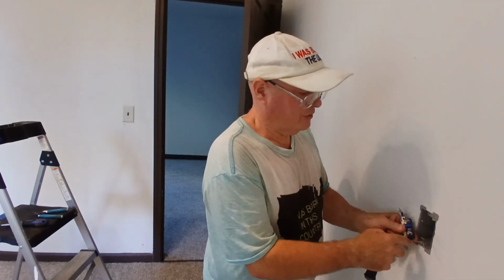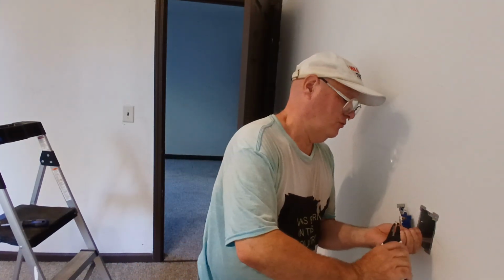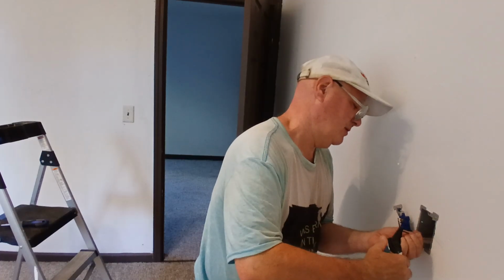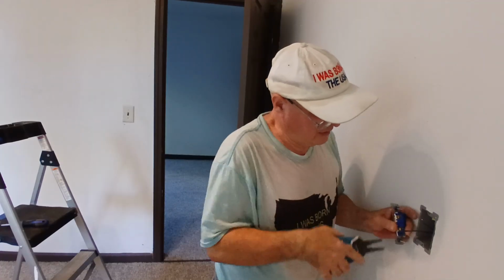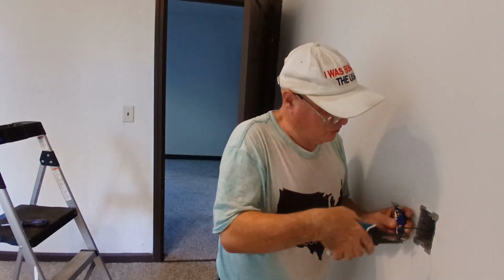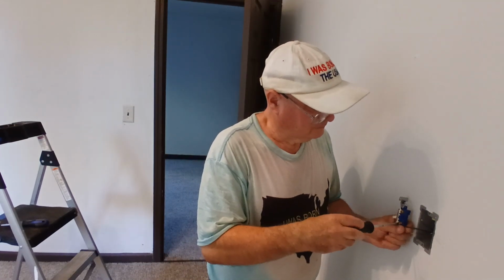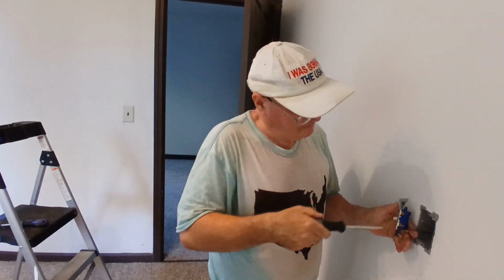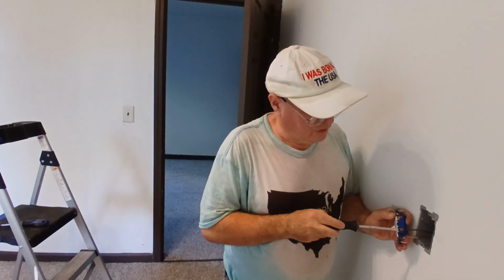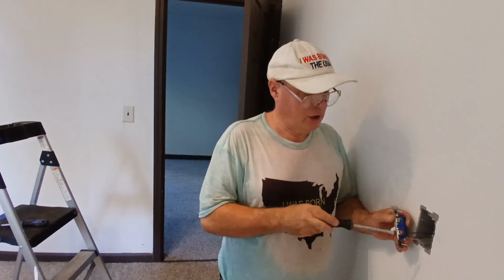Now we'll flip it around this way. We'll get our two black wires on our switch. It doesn't matter which terminal gets which wire. So again, we'll loop our wire the direction our screw turns, like that. You want to make sure you don't get the insulation under the screw head either. Okay, there's what we want, our copper up under the screw head all the way around and our insulation up close to the screw head but not caught under it.